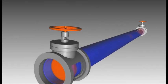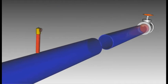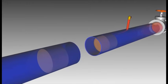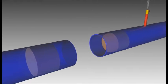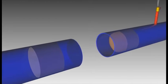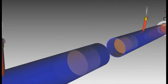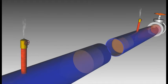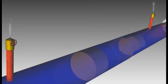Once the repair area has been isolated, the pipe is drained, the damaged section of pipe is removed, and the vents are installed upstream and downstream. The mud plugs are then built on the upstream and downstream sides of the open pipe, making sure that there is sufficient space from the end of the plugs to the end of the pipe so that the work can be performed. The vents should be monitored throughout the process to ensure hazardous vapors are vented away from the work area and that pressure does not build up and displace the mud plugs. Once the mud plugs have created a proper vapor barrier, necessary work can be done safely to replace the section of damaged pipe.